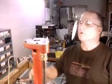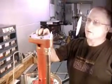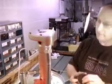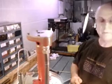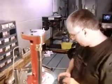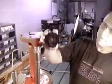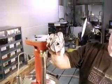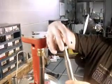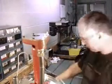Today we're going to go over the procedure to take your impeller off and replace it with a new impeller. A lot of times after a certain period of time the pump's been in use, they wear out, and you'll see there's an opening on the bottom here with two slots, and in our shafts we have a split pin on there, and that's how that fits on there and locks on. So that's how that works.